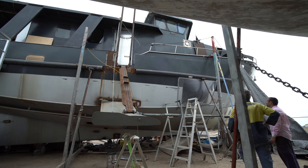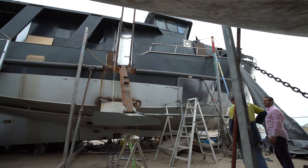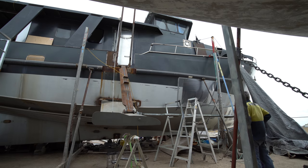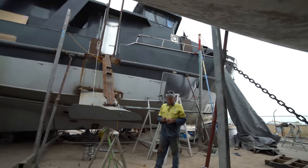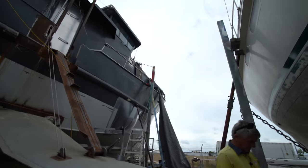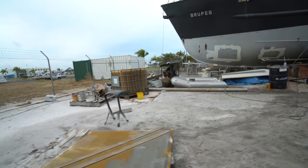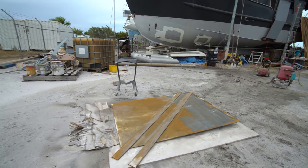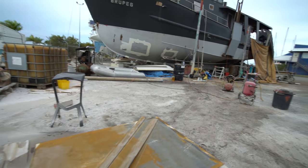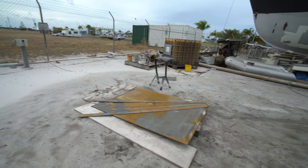It's all done! There's our sandblasting setup now. As Trev said, it's working like a charm. We've got our blasted steel ready to go. As always, we want a little bit of surface rust so that we can get our phosphoric acid to bond to it. He's done both sides of the ribs. We'll get those in tomorrow.